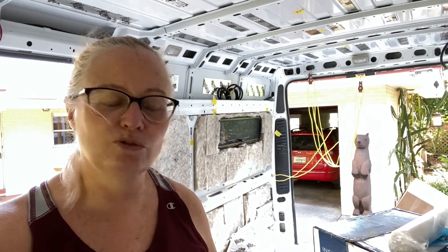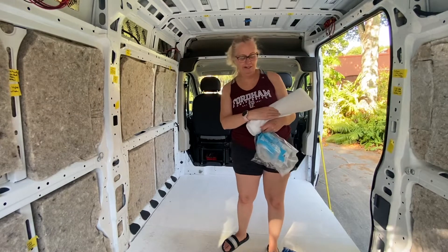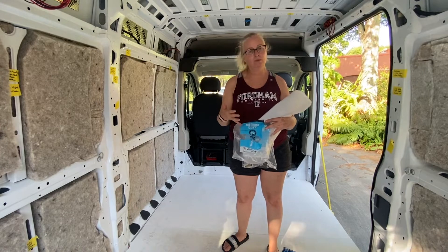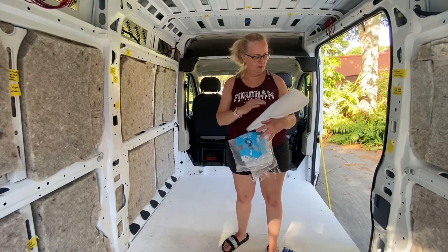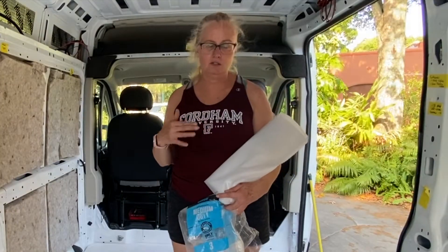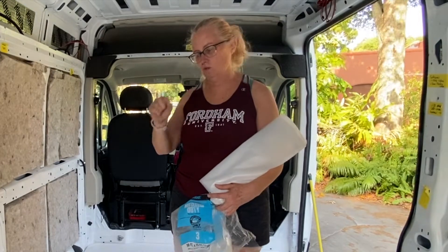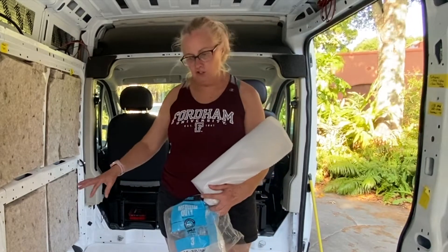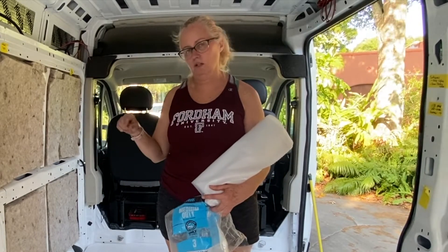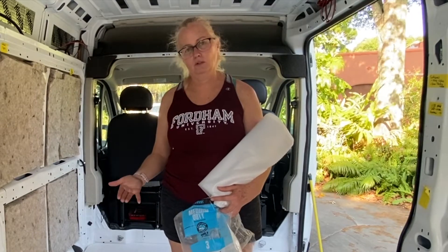I'm pretty excited that today I was able to break through the logjam of moving stuff around in the van. I fixed the subfloor and added a little extra cork underneath to make a nice smooth walking surface. Now I'm going to put in my vapor barrier - this is a three-mil plastic heavy-duty drop cloth from Lowe's. I'll use my staple gun to attach it around the perimeter of my subfloor and trim it to fit. The laminate I bought does include a vapor barrier, and I'll use backer rod foam tube around the perimeter with silicone to make it waterproof, so if something spills it won't seep below and cause mold or mildew.